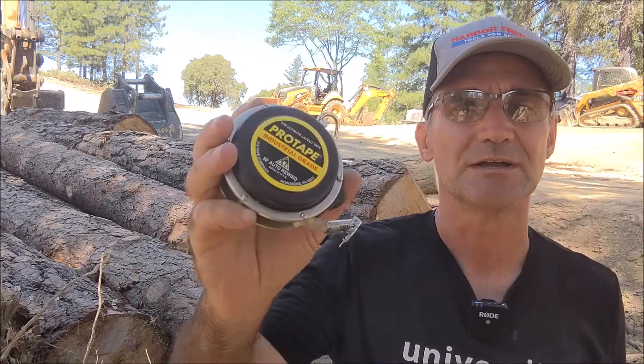Knowing board feet and its calculation is key if you plan on buying or selling lumber. To scale a log and figure out approximately how many board feet are in it, you need two measurements, which you can get with a regular framing tape, a logging tape, or layout tape. Those two measurements are diameter and length of the log. On the diameter, you measure the narrower end — if there's a lot of taper, you cut that off — so you always measure the smallest diameter, and you measure it inside the bark, subtracting the cambium layer.